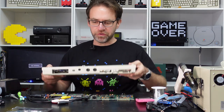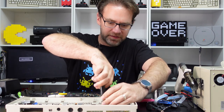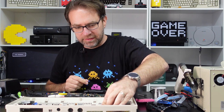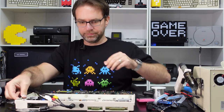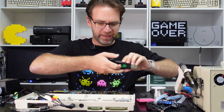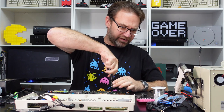Well, I guess it could be the VIC. Okay, well, luckily I do actually have it on the shortboard that I kind of forgot I had. So we can pull the VIC and the CPU. In fact, let's pull the CPU out of this one because it is already socketed. And we'll put this suspect one in and see if that works. Okay. So the CPU that was in this board did actually work, but I guess now it's in a socket. Yay. So we may as well pull the 6510 out of here.